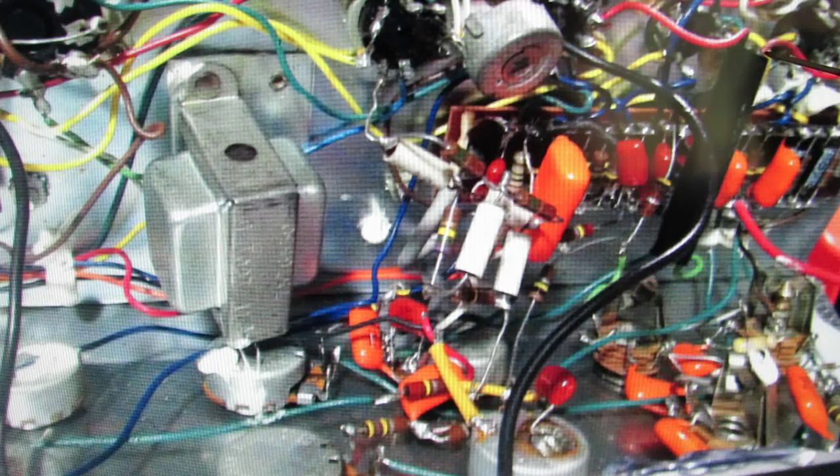It was one of these little leads right here, and down inside you can't really see the fact that the connector is just barely hanging on, and that when you hit a low note, it's causing that to move around and pop. And it was hard to duplicate this because you would get in here with a chopstick and move things around, and it wasn't necessarily doing it every time. You might move something over here that was just barely moving this component remotely, and then it would make the pop, so you'd misdiagnose it to some other part. Just trying to track that down was a big pain in the ass, to be quite honest. But once I finally got it tracked down, it was pretty easy to replace.